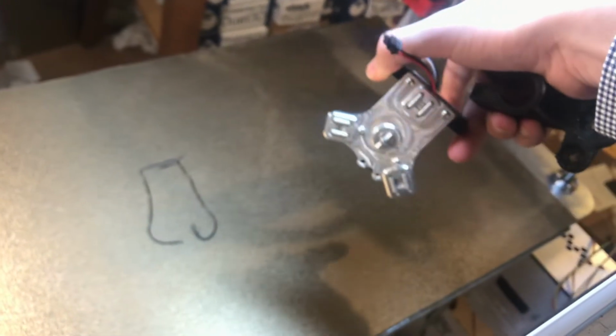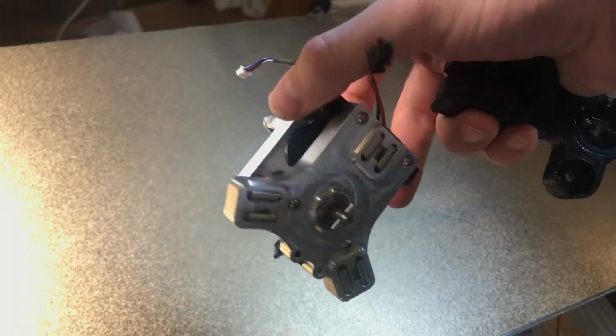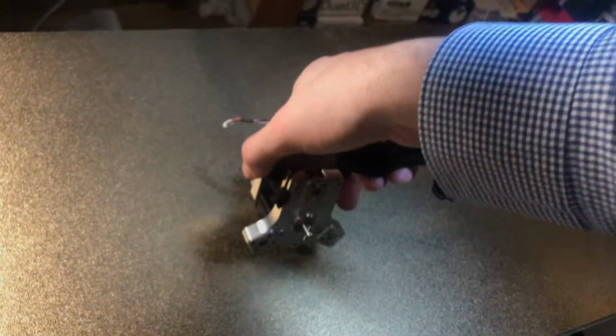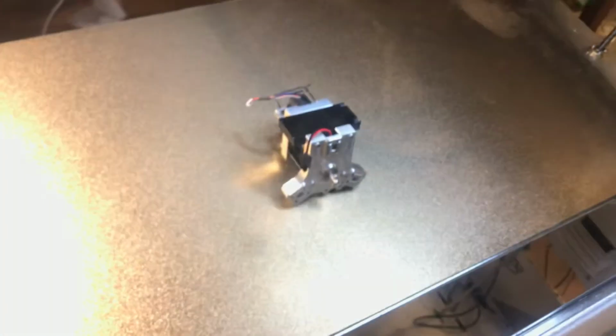All right, thank you guys so much. Interested, stay tuned for a little bit more info on updates with this machine. If you're interested in a large format CoreXY machine that will also allow for tool changing in the very near future. We've already developed a great number of tools, and again, we have modified the E3D's system of the actual tool changer to fit the much larger and more robust MGN 12 millimeter railing versus the 9 or so it was meant for. So it's a much sturdier machine and a much sturdier platform for tool changing in general.